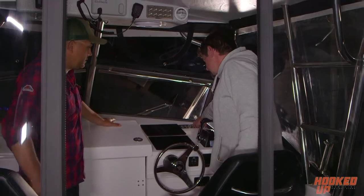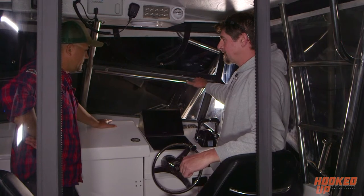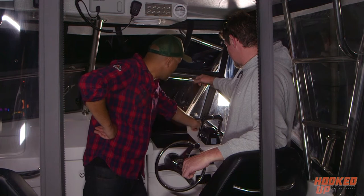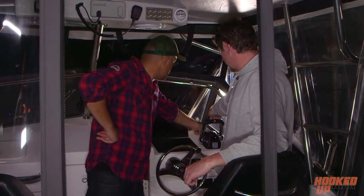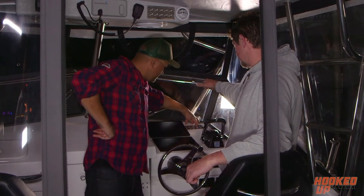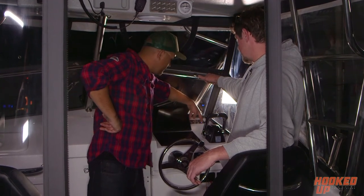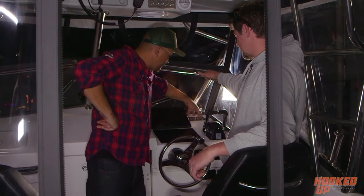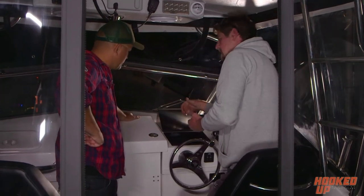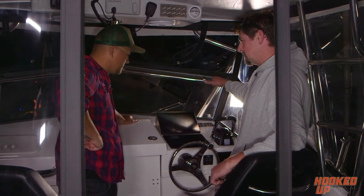So we came along and made a flip-up screen — eliminates all the sun glare. That is so awesome. You whack a button, one's up and one's down. That's a customised hydraulic lift for your unit, and then you can just adjust it for the sun. I made and designed all the stainless steel backing, the rams underneath it, and then just put it onto a switch panel. These are obviously networked so you can switch sonar or GPS — whichever one you want between the two.